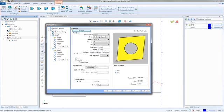So I'm always going off the corner, and that's based off the hypothetical tool tip here. So you got to think, if you went and touched off the front face of your part with the front face of this tool, that's going to line up your Z, and then you touch off the top, that's going to line up the X. And what your machine's creating then is this point where the two would meet. So it's given that hypothetical tool tip. The nose radius right there, that's the radius on the tool. And then the inscribed circle diameter is kind of the diameter of the insert. So this is a 1/2 inch insert. If you were to make a circle a 1/2 inch, it would hit every one of those walls. If you wanted to make a smaller one, 1/4 inch, whatever you put it into. Right there's the tool label, and then your orientation.